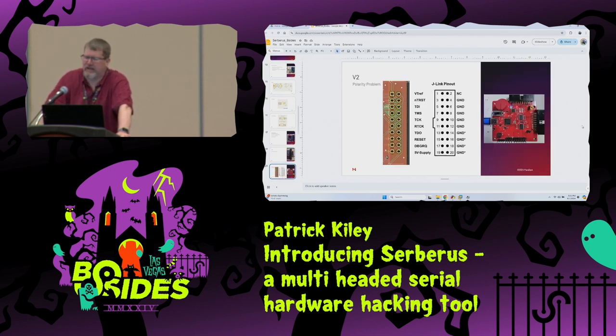So then I went into the second version, and I did it very quickly, and I just searched JTAG pinout. Turns out I grabbed the wrong JTAG pinout. I had the grounds and the signals reversed, so the grounds were actually on the keyhole side instead of on the other side, and so I did one more revision.